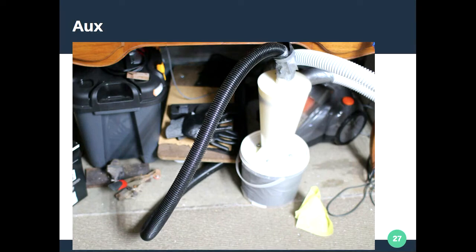I've got a cyclonic filter and a vacuum underneath. If you upgrade to a VFD, you'll need a pit of water and a water pump. It's a decision not to be taken lightly — milling aluminium requires all these ancillary things, the space for them, and maintaining them. It becomes not just a large box with the machine, but another large box underneath for water and for vacuum. With wood it doesn't really matter, but with sharp aluminium chips snow-globing everywhere you'll want to get rid of them.